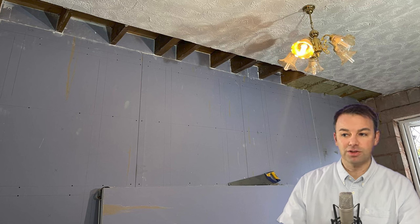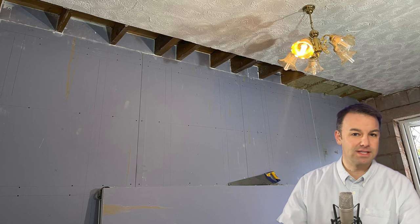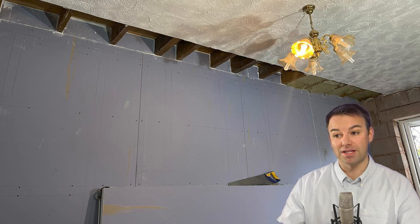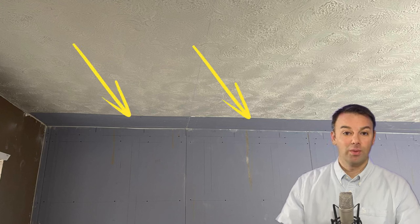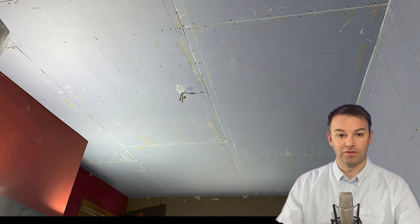The reason we don't seal the screw heads on the final layer of 15mm soundboard is that sometimes the sealant will come loose and get caught in the plaster trowel, since we're going to apply a wet plaster finish to this board and plasterers don't like that. We've then patched up the hole we cut in the ceiling to insulate and tuck the system up, using 15mm soundboard before going over the whole ceiling with the soundboard.